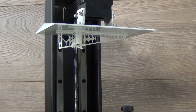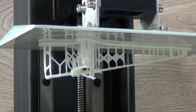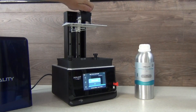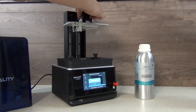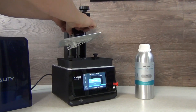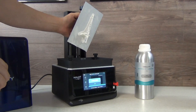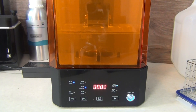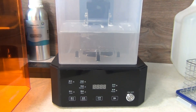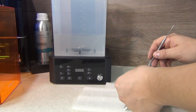If the initial layers are missing, you may consider stopping the print and checking the transparent film on the bottom of your tray. To do so, you have to remove the resin from your tray, filter it through the supplied filter, and inspect the bottom of the tray. If necessary, remove any stuck material. After printing is finished, the platform is raised to a certain height — it's good to let it rest for a couple of minutes so that the last resin drops can flow back into the tray. After that, it is necessary to remove the platform together with the model and wash off the excess resin. Whether you do it by hand or use a Creality washing and curing station is up to you, but once I got my hands on the UW-01, I fell in love with it.